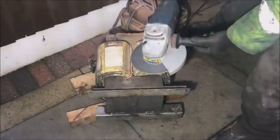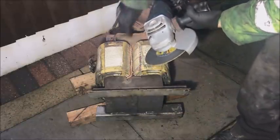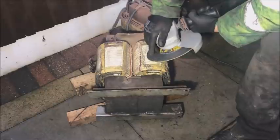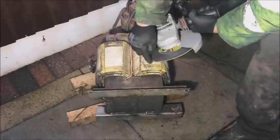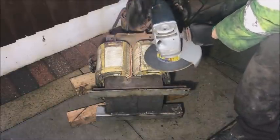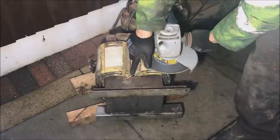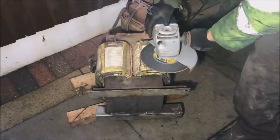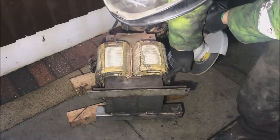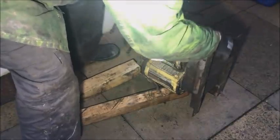If any of you are wondering just why I keep coming off and going into the metal - well, the copper's soft and this disc is designed to cut steel and stainless steel, so it does tend to clog up. Go into a bit of steel, it cleans it. I carry on cutting until I'm getting sparks all the way across, then I know I've gone through and hit the centre core.